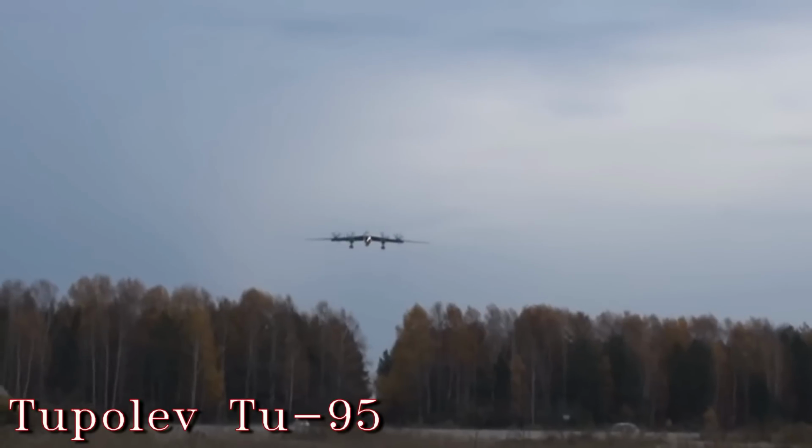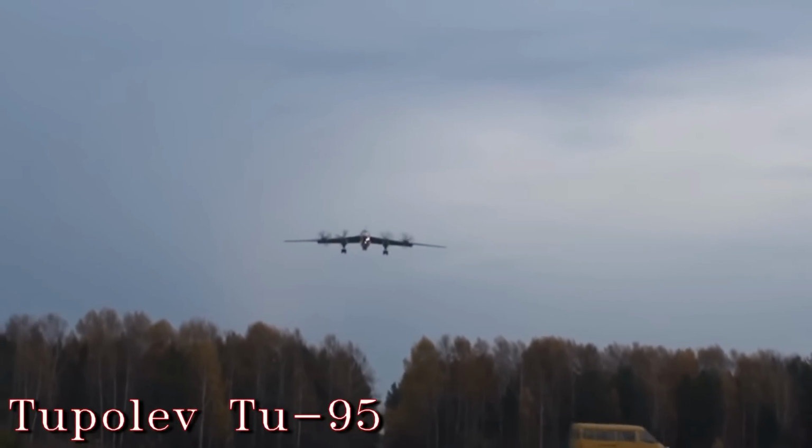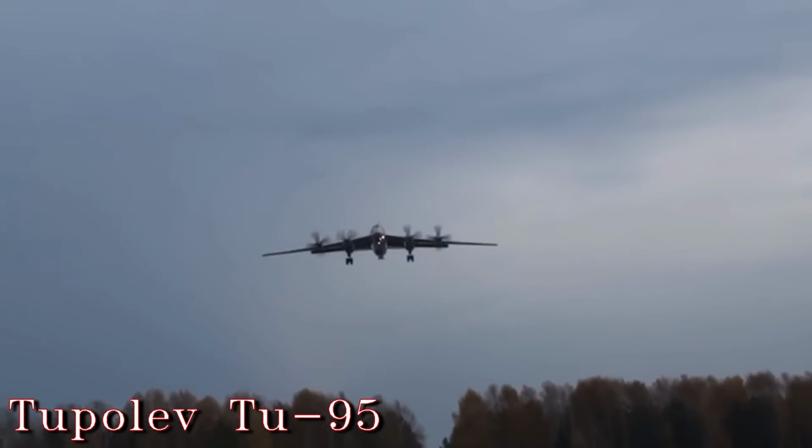Meaning a well-designed contra-rotating propeller will have no rotational airflow, pushing all that air uniformly rearward, resulting in higher performance and a lower induced energy loss. Fun fact is, contra-rotating propellers have been found to be between 6 and 16% more efficient than just normal single propellers. Also, one of the most well-known aircraft to use this design, still flying today, is the Russian Tu-95 Bear.